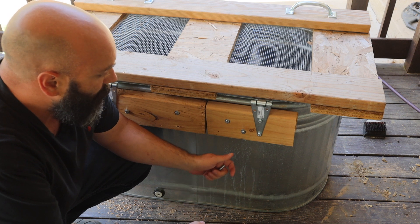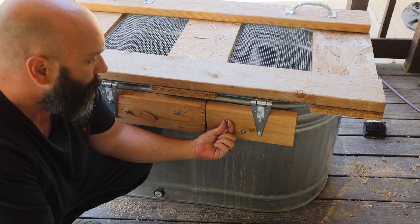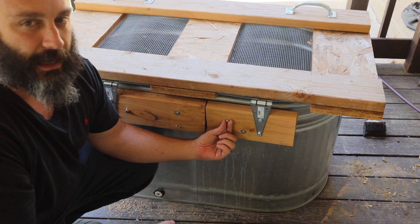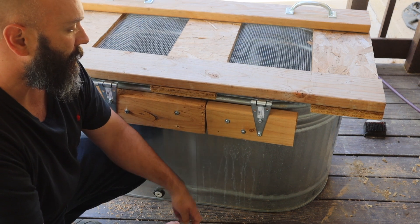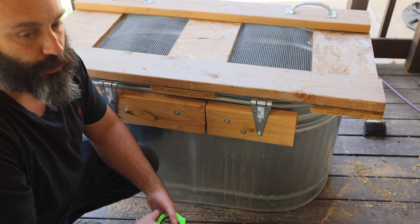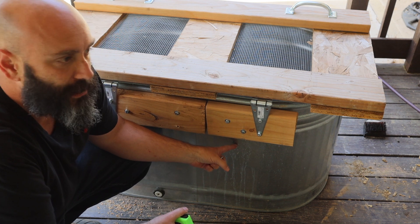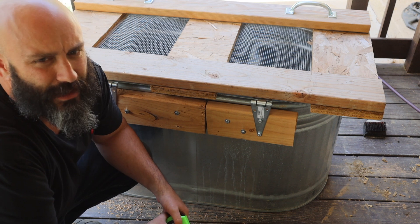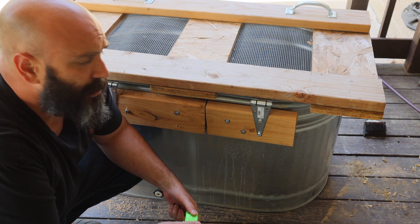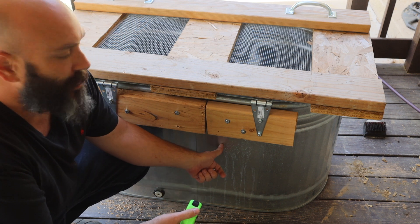To go through the wood and into the tank I used two-and-three-quarter lag bolts — they could have been a little bit shorter. I'll show you in a second how they stick out just a little bit, but that's what I had on hand: nut, washer, and a two-and-three-quarter bolt. I used the Bosch cobalt bits again — highly recommend those to go through the wood and the tank itself. I only needed one bit, the three-eighths bit — didn't have to step up through several sizes. It was pretty easy to go through this thin sheet metal.